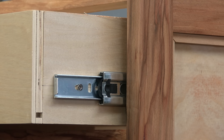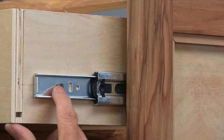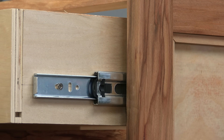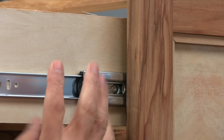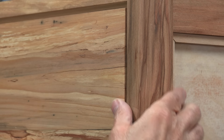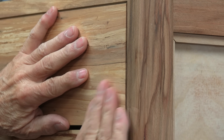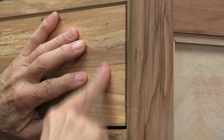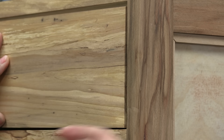The faces are fitted but I left wiggle room using the horizontal slotted holes on the slides. I've loosened those slotted screws — two on each side — and can now push the drawer back slightly to get a perfectly flush side alignment. Once I'm happy with the fit, I'll use double-sided tape to tack the face spacers in position, then drive screws from the back side.